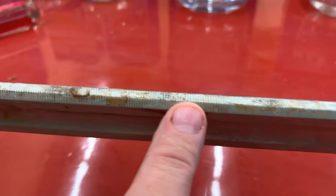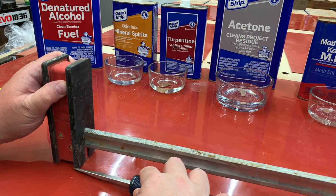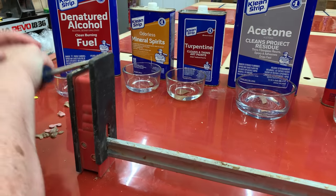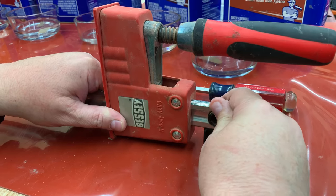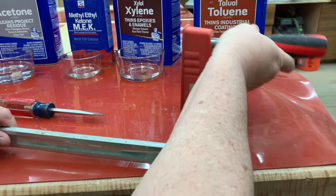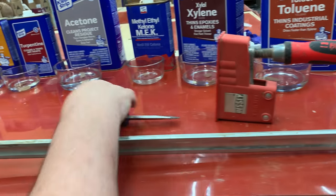So we're going to take a look at this clamp and we see that we've just got glue embedded in the grooves — it's all over the place. We've got thicker and thinner pieces. The best thing to do is to disassemble the clamp a little bit. We're going to pull off the protective face from the clamping surface and try to clean all the surfaces. We'll pull the clamp apart — I'm going to pull out the stop and take the clamping body off the bottom end so I can get down to the bar and clean it properly. I'm noticing even the threads aren't moving very smoothly because there's dirt and possibly a little glue in there, so we're going to make sure we clean that up as well.